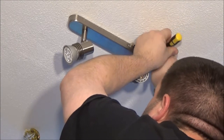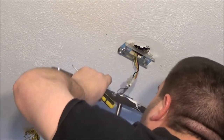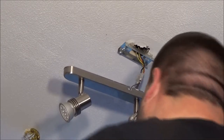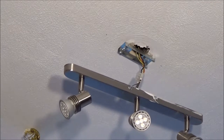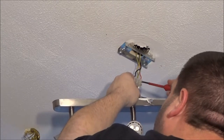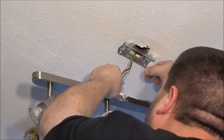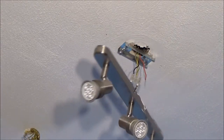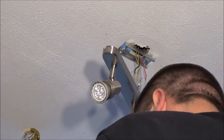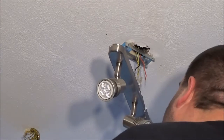Oh, it should slide, and it doesn't want to slide. So, now we should. There we go. Right. Get that one off. And what I'm going to do, I don't know what's going to happen. I'm going to clang this wire with the earth or the bloody neutral, and it'll trip the RCD. Even with power off, it can still trip an RCD.